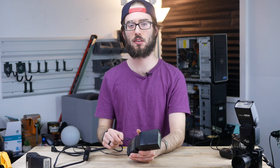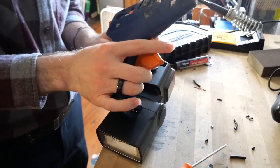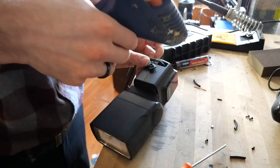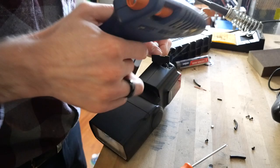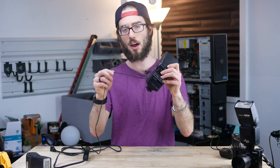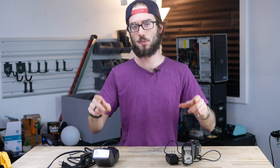That's solely because the wires are directly connected to the board and I'm not going through a screw. Once I soldered the wires to the old battery terminal wires, I weaved the wire through the rest of the chassis, put the flash back together, used a little bit of super glue to get everything nice and snug, and voila — I have a non-removable cable and a way to constantly power my flash.